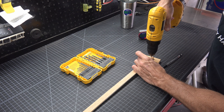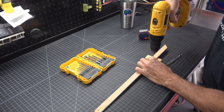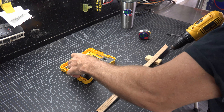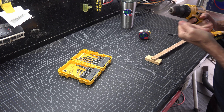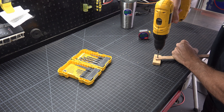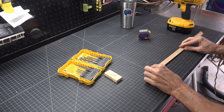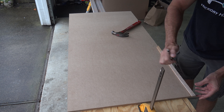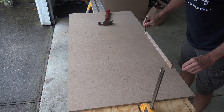I started with some half-inch MDF boards. I wanted this to be as light as possible since I knew it would be hanging on the wall like a shadow box. So using my trick for perfect arches, I drilled two holes in each end of a piece of scrap wood and used it as a pivot to trace out my arches. Putting a brad in one hole and extending the lead of my pencil to fit through the other hole, I drew out my arch.